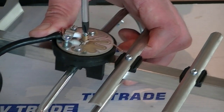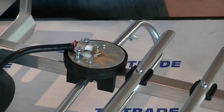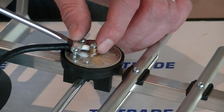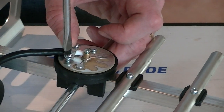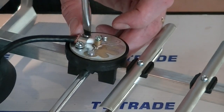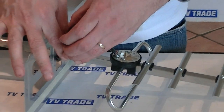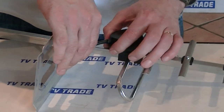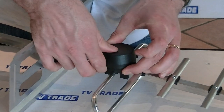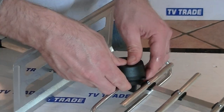Screw the core wire into position and lock it in, then use the snips to trim off any excess. Push the braiding in firmly with the flathead screwdriver to ensure a good connection, then screw it down into position. Slide the capping along into position and clip it down to get a good watertight connection all the way around, then line it up so it runs straight back.